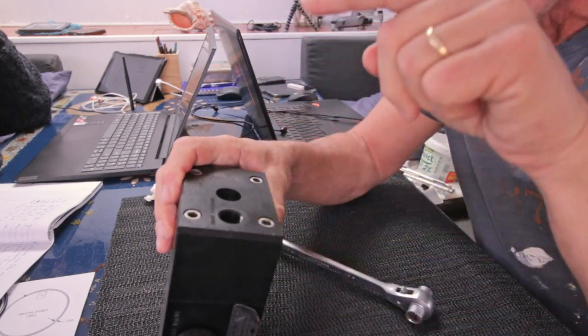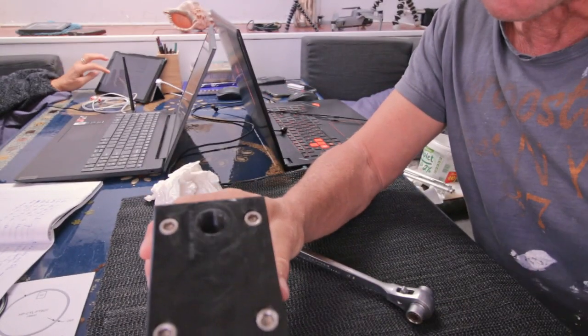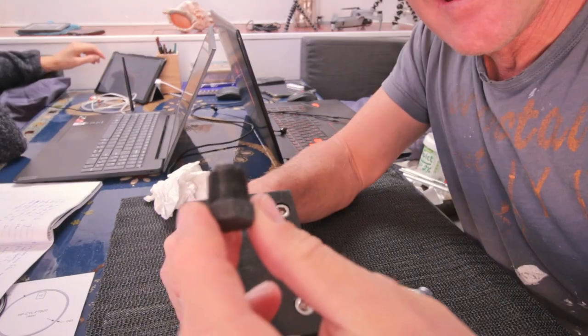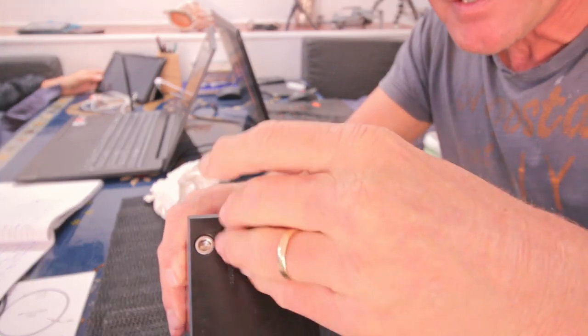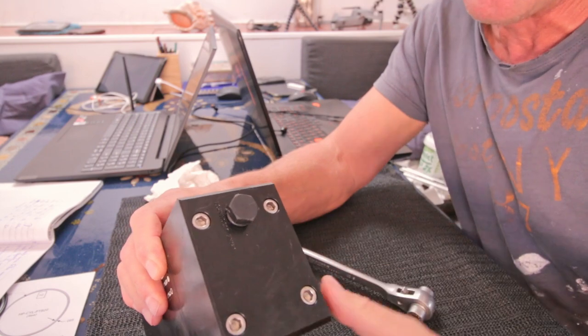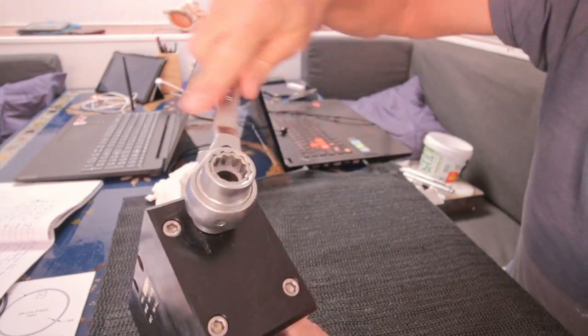In our case, the brine outlet is on this side, so I'm going to plug this off. This is a kind of hard plastic, and this is a plastic fitting to blind off this hole. And because this is plastic, I'm not gonna use the Teflon tape because this should be closed off now. Let's see, not too tight.